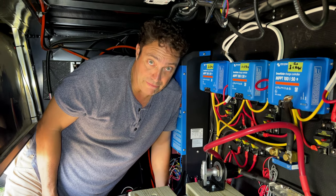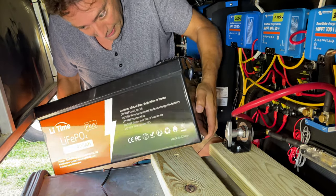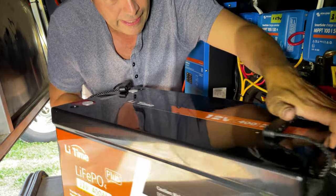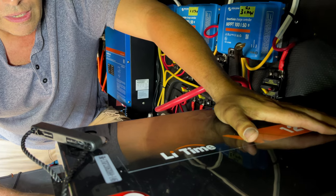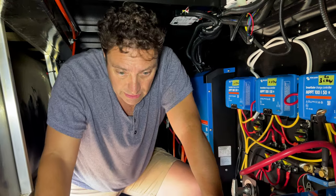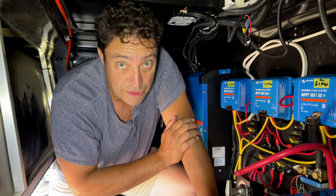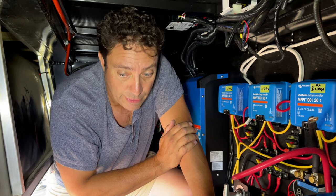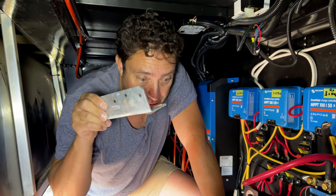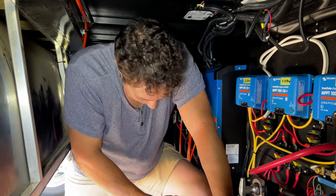It's only 85 pounds. There we go — one, another one to do. I want to work down the tie-down points — these are the ratchet straps. You've got to anchor these things because you don't want them moving around when you brake, accelerate, and go around corners. I've got my angle plates here which will stop them moving sideways.